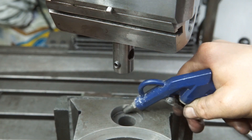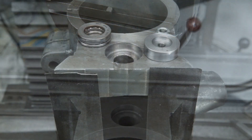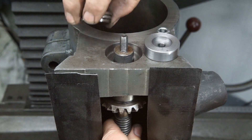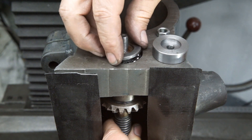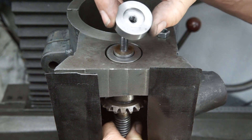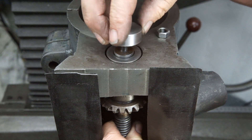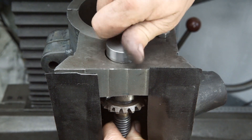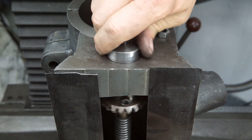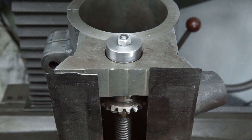This time I was happy with the result. Off camera I made a washer with a recess and inserted and glued an M8 thread into the spindle. The test fit was really satisfactory — no play at all and the spindle ran smoothly.